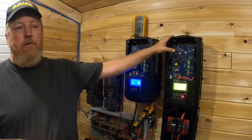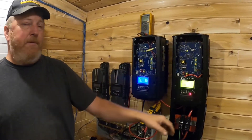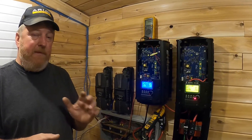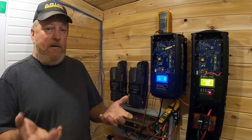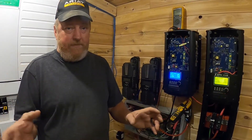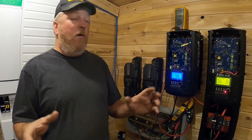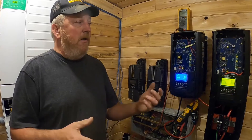We'll run some 2-wire cables down temporarily. We currently have two strings on the roof that come together and combine on this unit, so we'll run them separately. He's going to be working this weekend on making the two sides of the Barcelona track independently of each other. The Barcelona is actually a dual MPPT — you can put one array on one side and a different array on the other, or a wind turbine or hydro turbine on the other side.